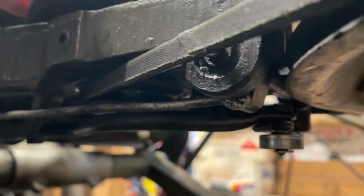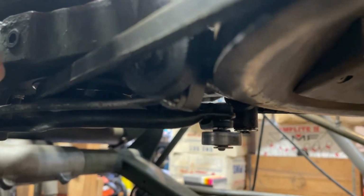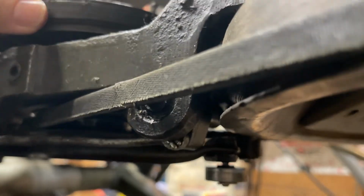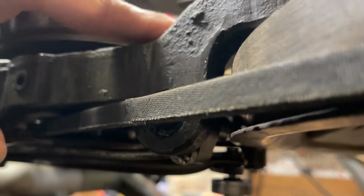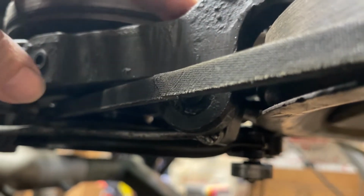which allows the pedal not to lock this guy back in place, because this thing only locks in place up front. When the pedal's up, it positively locks that in place. You get a lot of slop in there. This can allow the cam follower to ride one extra time when it shouldn't.